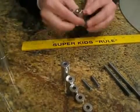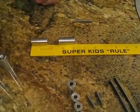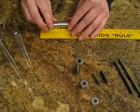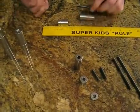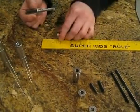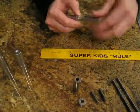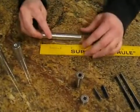We will take our two end pieces that are threaded. Use your ruler and mark it. Then you'll take your spacers and put them in to make sure it's the height that you need. Take one of your end pieces, screw in your threaded rod, take your spacers, slide them in, take your other end piece, and screw it in to the end until you get your 4 inches.